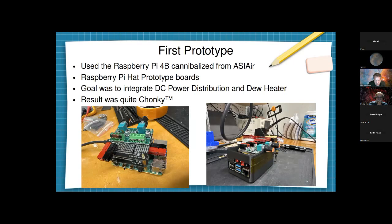I had a Raspberry Pi 4, and off Amazon I ordered some Raspberry Pi HAT prototype boards. The Raspberry Pi, like I said, is highly hackable. They sell these boards, it's called a HAT, hardware attached on top. These are prototype boards. You can see they're just little traces on here. You can put transistors, resistors, LEDs, whatever you want on here, and then you hook it up to those GPIO pins. These came in a 6-pack, so I hooked 2 on here.